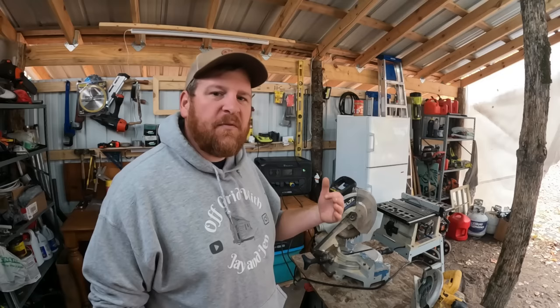Also, another thing that we found we like is the Bluetti AC300 has a nice app. You can monitor everything, turn things on and off through that app, all from your phone. So if you stick with the single AC300, you could put up to 4 batteries in it and get over 12,000 watt hours of LiFePO4 battery life. Or if you need more power for your home, you can get a second AC300 and run them in split phase and have up to 8 B300s all at once, giving you over 24,000 watt hours of capacity.